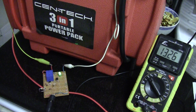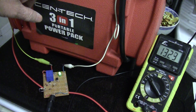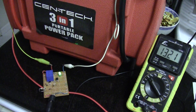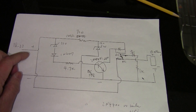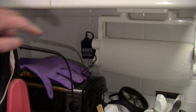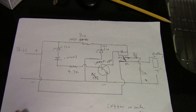You see the voltage falling back to around 13.1 or 13.2, which is what you should keep this battery at. You don't want to keep it at 13.8 or 14 volts — about 13.2 to 13.4 volts at most. It uses a power supply like this one I took from Harbor Freight: 600mA and about 18 volt open voltage.